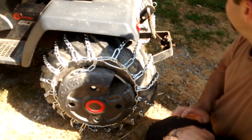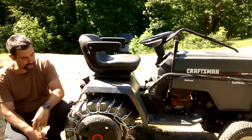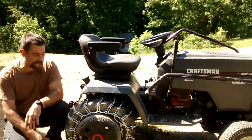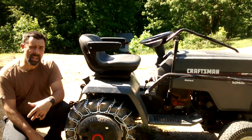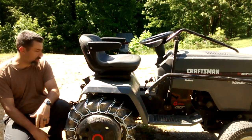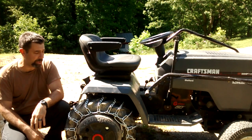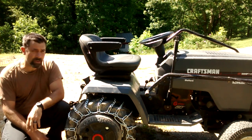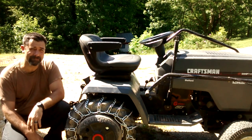So that wasn't too bad! About 20 minutes into this and we've got our chains on. They're sort of tight. I'm going to go drive it around once or twice and make some final adjustments if I need to pull some slack out — and I do, it's a little bit loose, especially on the inside. I'm probably going to invest in bungee cords — I think they're about $8 — for a set for the inside to help keep them taut. You can do it with just regular bungee cords, but they make a nice round set with four hooks that grabs it from all sides. For the money, why not splurge? So that's it. I'm Eric, owner of Farpoint Farms. I hope you enjoyed this video, and now you know how to put chains on your tractor — because who doesn't need more traction in life, right? Take care.